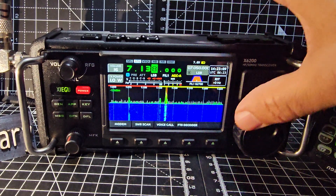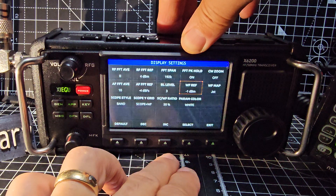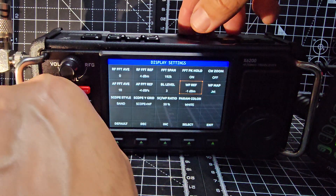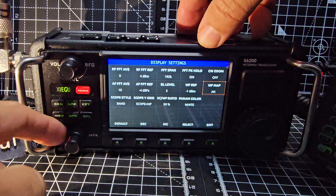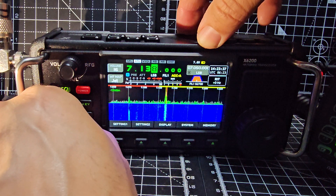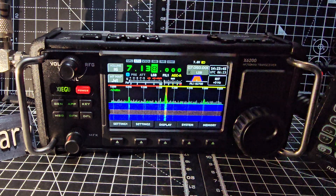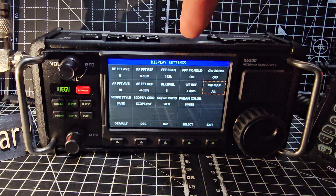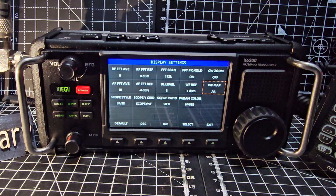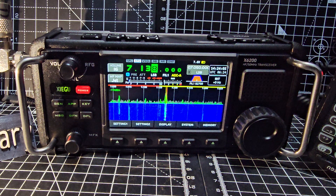All you do is go to display settings - press General, then Display. Change the WF map here - change it. It's quite bright, set to Jet, so you move the bottom outer knob until it highlights Jet, press it. Waterfall reference is minus 1 dBm, AF FFT reference minus 4, AF FFT average is on 10. The span is 192 and 4 dBm.